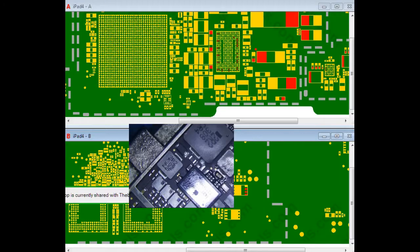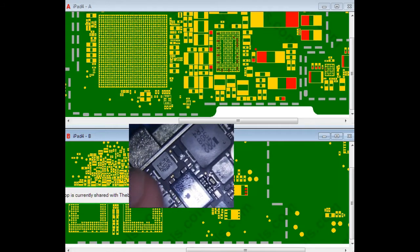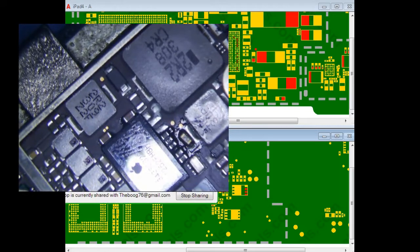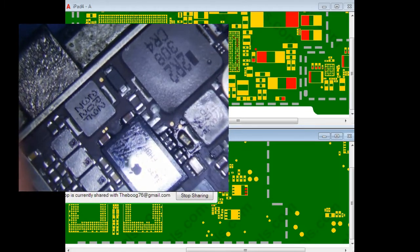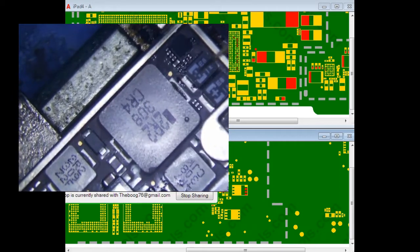Pause. So, that didn't work. I was getting the same result, 0.8 amps on the PortaPal. This video is really about changing the TriStar, so I'm just going to tell you where I'm going to go from here, but this video is not going to include that. So that was the TriStar repair on an iPhone 4, iPad 4. After I finished it, plugged it in, 0.8 amps, and then I finally decided to do some short testing.